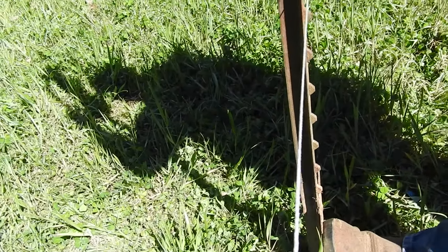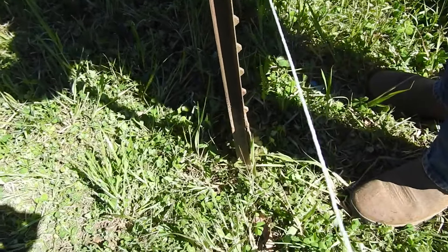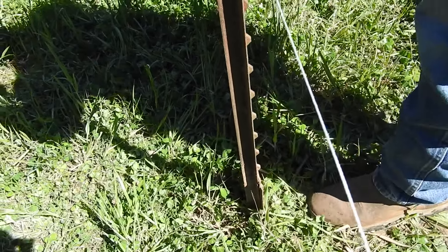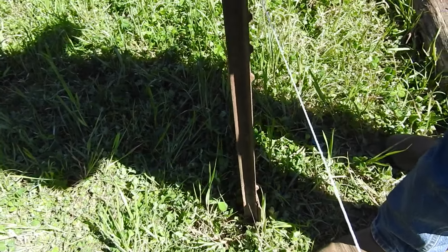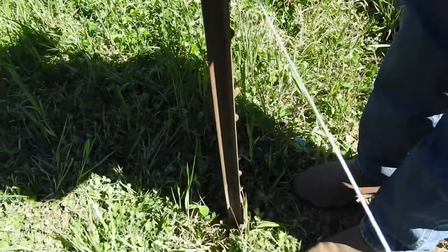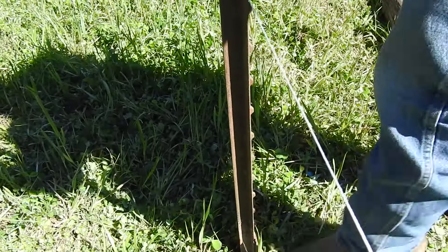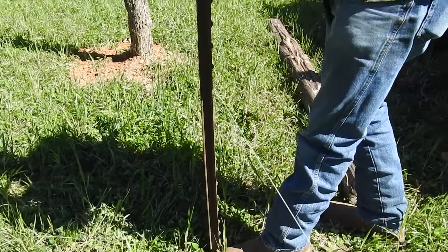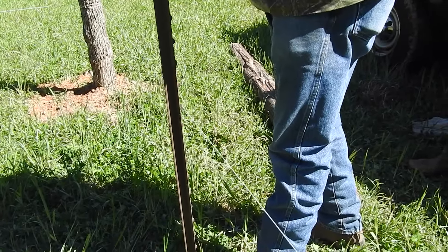And you can see how it turns to keep it straight. When you get somewhat down in there, it's going to be off the line. Before you get this plate in the ground, pull it a little bit just to straighten it. And it ain't going to really do anything as in loosening the T-post, because you still got plenty of distance that it's going to be down in the ground.